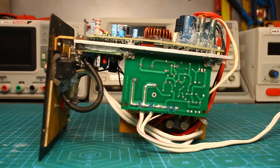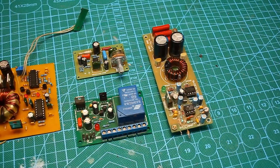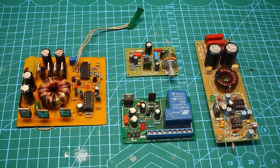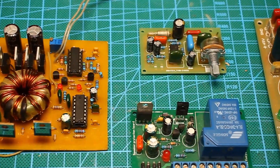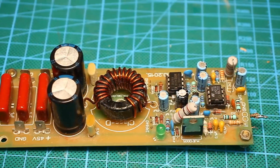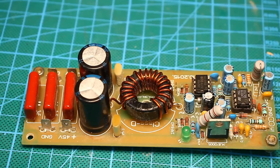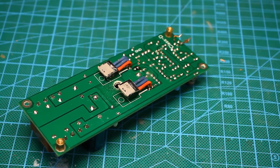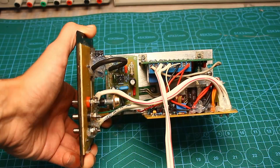This project is a complete car amplifier for a subwoofer consisting of several parts: a voltage converter, an acoustic protection unit, an active low pass filter which is also an adder, and a power amplifier — in this case class D. Everything is thorough here: a bunch of all kinds of protections, a rather powerful amplifier, and all this is mounted in a subwoofer box.